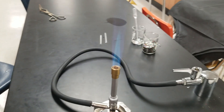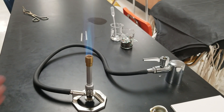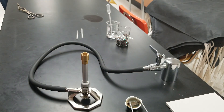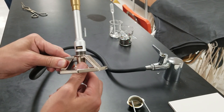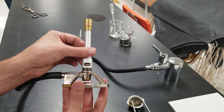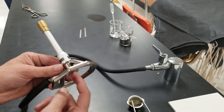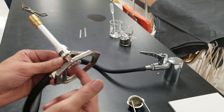Now, as for this, you do need to deal with this flame now that you're done. The way you deal with it is you shut it down — you turn the flame off by turning off the gas right there. Once that's off, you need to do an additional safety measure. Proper shutdown procedure is you also turn off the gas by screwing the valve all the way in this direction. Then as a courtesy to the next person, you're going to want to close this air vent. If someone accidentally turns on the gas, you won't fill the room with natural gas because this will prevent that gas from escaping into the room.